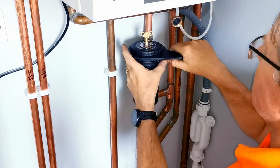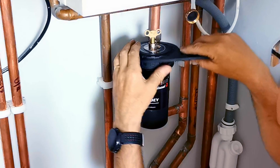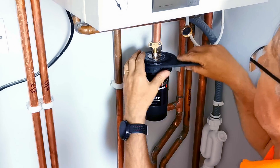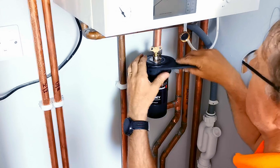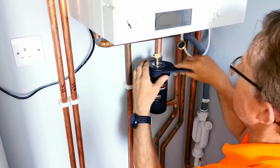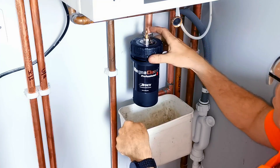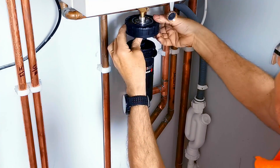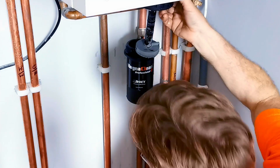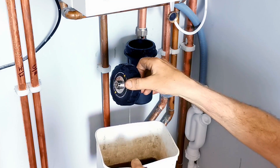I'm now going to use the large ring spanner to undo the lid so I can remove the MagnaClean and clean it. Just a word of caution — these MagnaClean lids can be really tight and hard to undo. Take a look at what's above and below the MagnaClean, because you don't want to put a lot of force on the lid and cause a leak on another fitting or on the MagnaClean valves themselves. If the lid is really tight, you may want to consider removing the whole MagnaClean — I'll show you how to do that in a minute. Watch out for a bit more water running out the bottom as you undo the lid if you have removed the plug. Whenever you lift the MagnaClean out you will always get water dripping, so make sure you've got a bowl handy to catch any water.